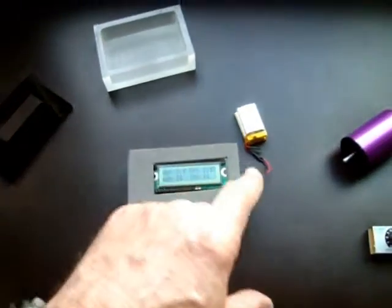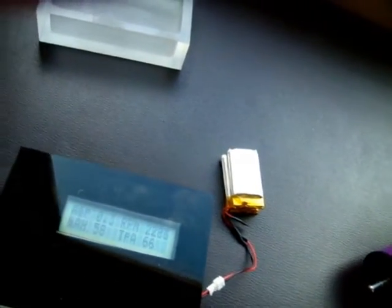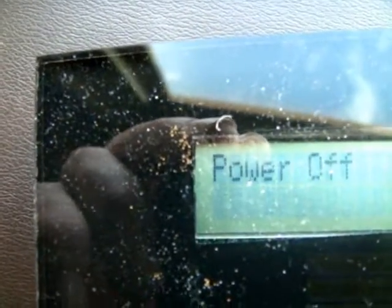Machine case, electronics, dual lithium battery, waterproof seal in the top, but I've added one more thing. To turn the unit on and off, what we do is we have a magnetic capability. So all I need to do is put a little magnet, which could be on my ring or my index finger, and it would turn it off. Now let me give you an idea how that works. I've got a little neodymium magnet here, so what I'll do is I'll come in proximity to this unit, and if I come in close, pick the right place, there it is, it's muted, turns on, I can hold it there and it will actually cycle the unit off completely. On again, off again. So it's very easy to control the on-off position just by this little magnet switch.